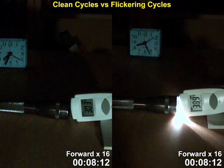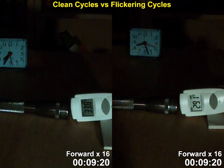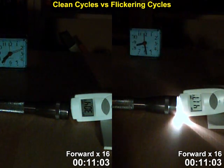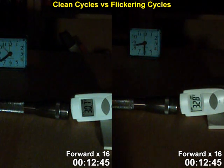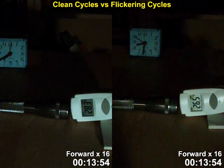But if the weld is weak, then the contact surfaces start to separate slowly. This will generate a molten contact bridge that takes more time to burn out. As the bridge gets degraded, contact is repeatedly broken and re-established again. This may either cause the contacts to weld together again, or the contact point gets so degraded that the lamp goes off.